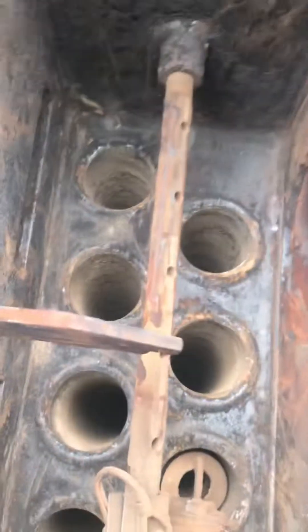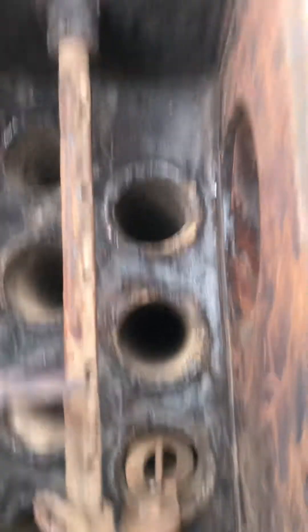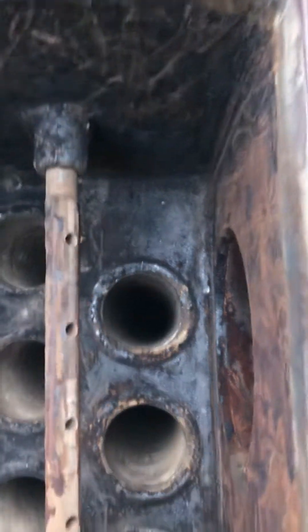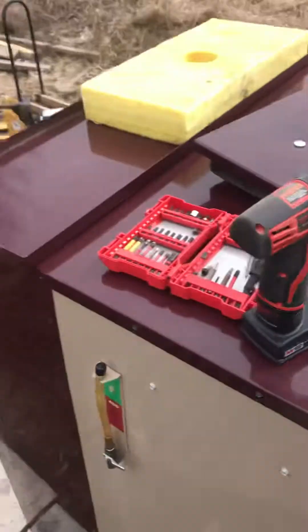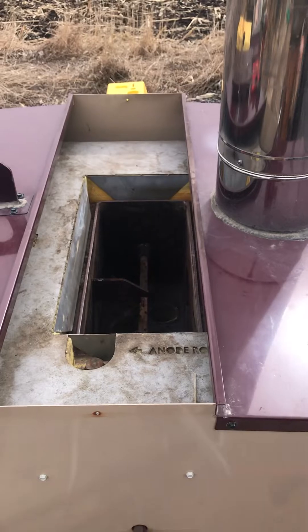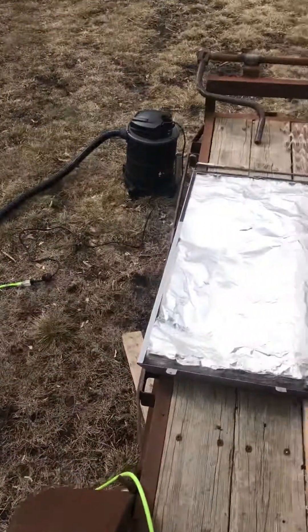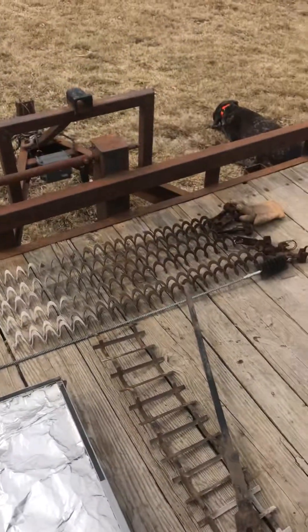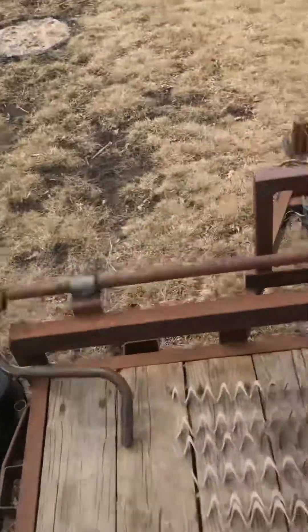The reason Polar gives you access on top is so you can look down in and see any buildup — and these do need to be cleaned out better than just moving the turbulators up and down with the handle. Take the bore brush and clean them out. If your boiler does not have access to the top of your heat exchanger tubes and does not come with a bore brush, you will lose efficiency over time with buildup you can't remove. Ease of use and ease of maintenance between Polar and Central Boiler — very, very different.